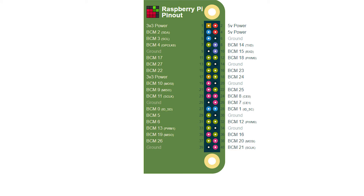We need a 5 volt pin, a ground pin, a 3.3 volt pin, and two general purpose pins. I chose pin 1 for 3.3 volts, pin 2 for 5 volts, pin 6 for ground, pin 11 for the relay (one of the GPIOs), and pin 40 for 3.3 volt sense.